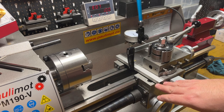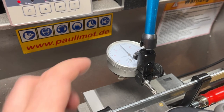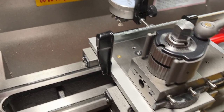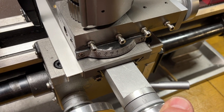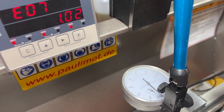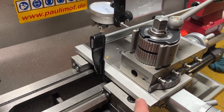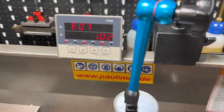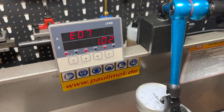I would say that all this setup should work. I will measure where the screws should be and drill the holes now for this scale. Small test: I have 0 over here, 0 on the DRO and 0 over here. I am moving 1 mm — I have exactly 1 on the DRO and 50 on the micrometer. It's more or less accurate. I found the position for the scale. It was not really easy to set up the DRO — the entire manual is in Chinese language, it's terrible — but I found a way to translate it.